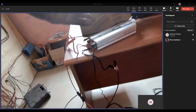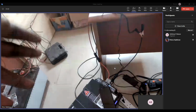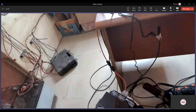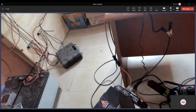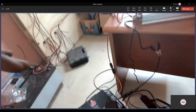yes, this is advisable to use because, first of all, apart from discharging the battery, you need to be able to charge the battery to full to complete that cycle to be able to use it the following day. Because if you don't charge the battery well and you are using and discharging it over time, the battery will default, because it doesn't get to full capacity again.